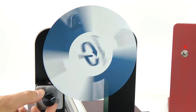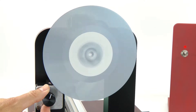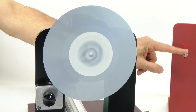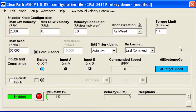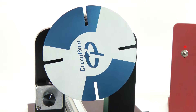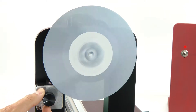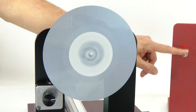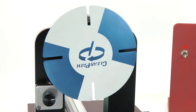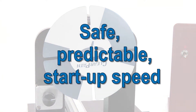There are some other benefits to using a digital knob. For example, you can have ClearPath remember its last speed when it's turned on, like a potentiometer-based system, or you can have it reset to zero speed when it gets enabled, which is often desirable for safety reasons. In either case, the startup speed is always predictable. Changing the knob position when the motor is disabled will not change the startup speed.